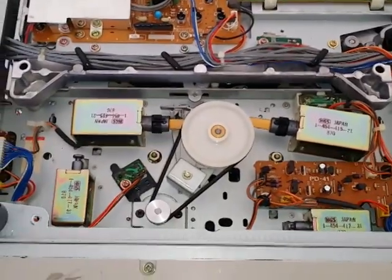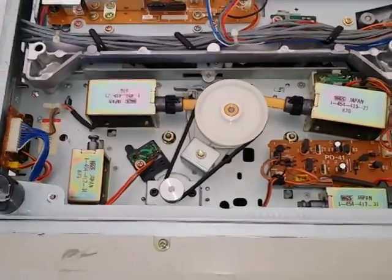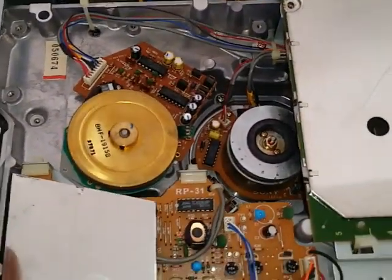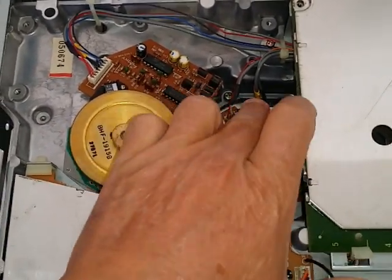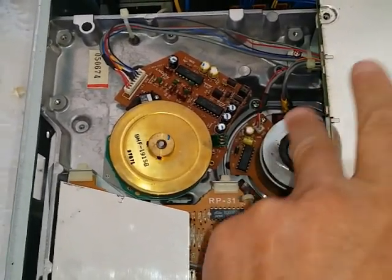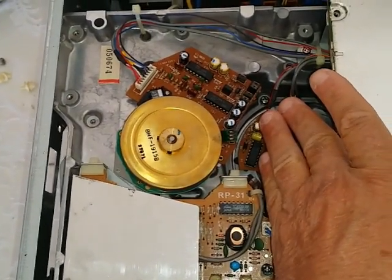Okay, here's the bottom of the Sony VO-9600 3/4 Umatic machine. As you can see, I flipped the machine over, and you're going to notice you got several things here. Here's where, up on top, I replaced the video scanner. You have to bolt it down here. This is where the video head is. When you put the new scanner in, you got 3 bolts. You change it out and plug in 3 different wires. Pretty simple.